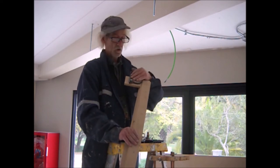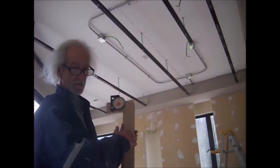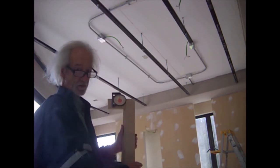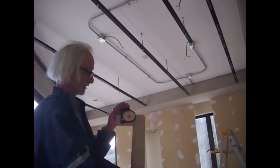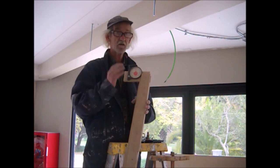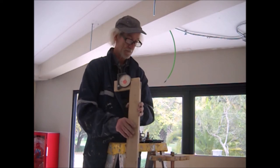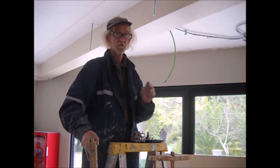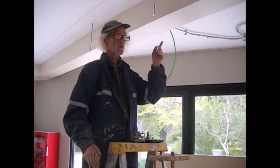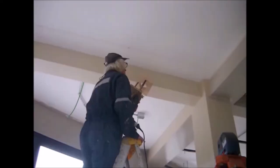All those holes, most of them, about 90%, are out of line. Their deviation from the vertical is just too much, about 2 or 3 centimeters in some cases. It would have been better if I'd used the hammer drill on its own. Finally, I had to beat them with a sledgehammer to get them perfectly plumbed, or redo the holes in the steel channel. My idea is not having to do that, or beat them the least possible. So I will be doing these holes, each line, with a different tool, and then I'll share the results with you.